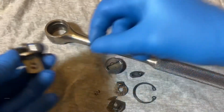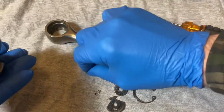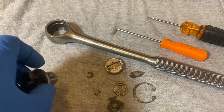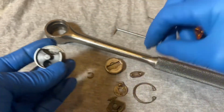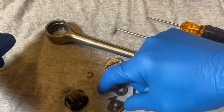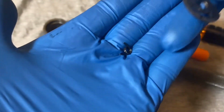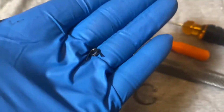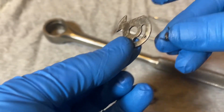And the small snap ring snaps into that groove there. Okay, to put this back together, put the spring back in the hole, put the pawl on top, set it down, grab your bottom switch plate. Here's the spring, by the way, for the bottom switch plate. Okay, you take the bottom prong of the spring, you put it through the bottom hole, and the other prong, you just thread it through that cutout like that.